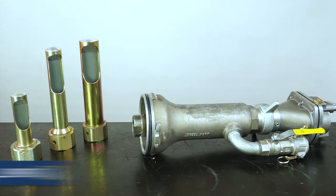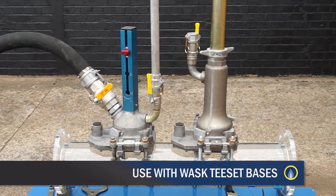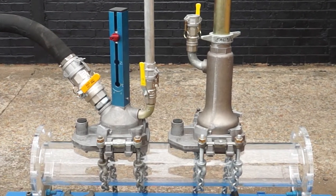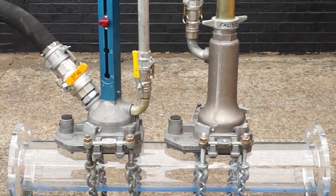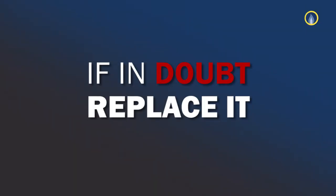The WOSC Single Hole Bagging Kit is specifically designed for use with WOSC T-set bases, both earlier Mark I and latest Mark II types, and in conjunction with WOSC Bypass Equipment. It must not be used for any other application. If the equipment shows signs of damage which could cause personal injury or affect the flow stopping procedure, if you have any doubt, replace it.